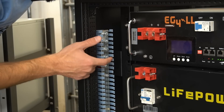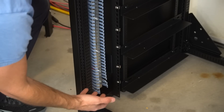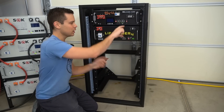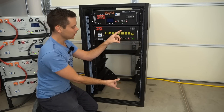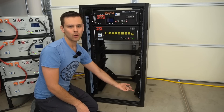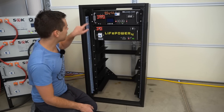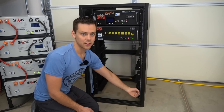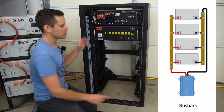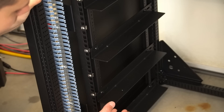The main connections for this bus bar are on the top — there are no main connections on the bottom if you want to do a diagonal configuration. So you're going to have to take the bus bar out, rotate it, and either remount it or drill holes into the copper and tap them to add your own bolts. That way you can configure the wires properly: main positive on one end and main negative on the other. You still need it diagonally connected.